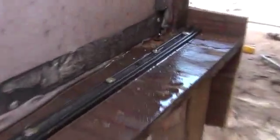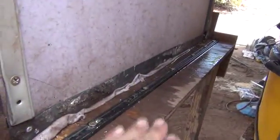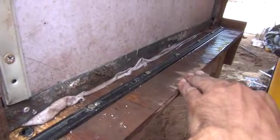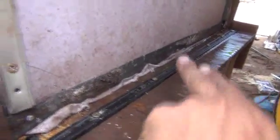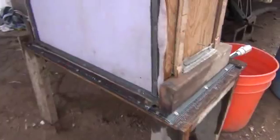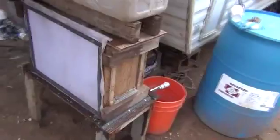There's the quick and easy updates. You can see the tube coming in right at the corner there. You can see this flashing chunk that I had to screw down right here all the way on both sides — that helps make it so if the water rolls off the sheet towards it, it will stop most of it and roll it back towards either one of the corners. I've crowned the center of the refrigeration board here at the bottom — you can see it's dry at the center. I crowned the center with this piece by how I screwed it on, so water would roll to one side or the other and not just get caught up in the center. If it was bowed down in the center it would do just the opposite, and you might only need one pipe. So once again, there's an update to an evaporative refrigeration system that is now a recirculating system.